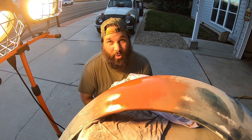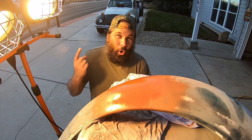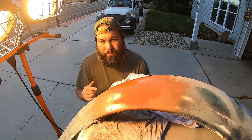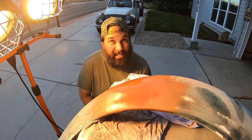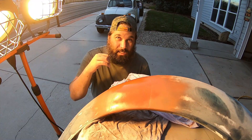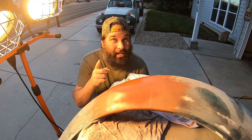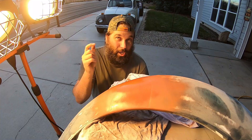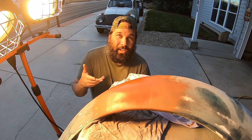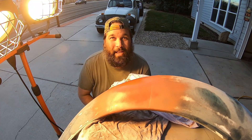To be honest with you, I really don't see a big difference between the glass bead or the fine coal. I like the coal — the coal is the winner to me. It's cheaper, it does just as good. I'm sure there's a very good reason to use glass bead in delicate situations — it would be much better. A glass bead is just that, it's a bead, it's a smoother surface, whereas the coal has a more jagged surface, at least from my understanding. If you know better, please let me know by dropping a comment below, because I do want to learn and I want to make sure I'm keeping myself honest. I want everybody to learn something, so if I'm wrong, I'm okay being wrong — just point me in the right direction.